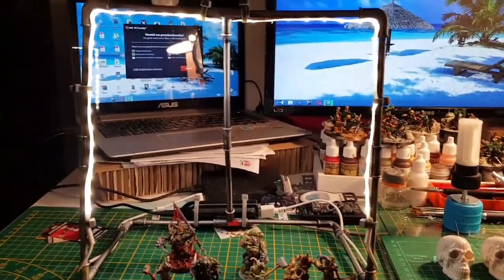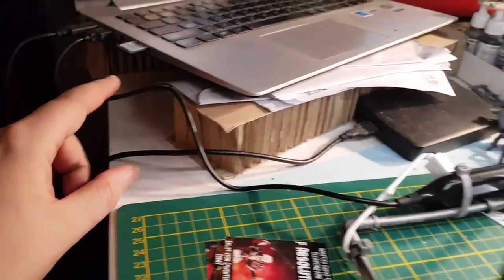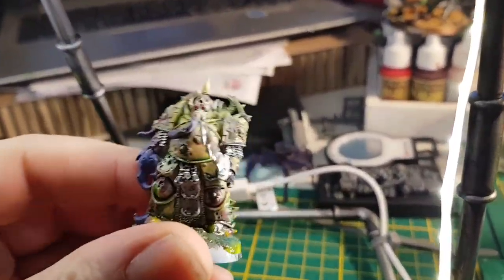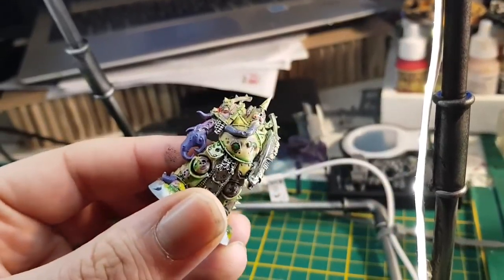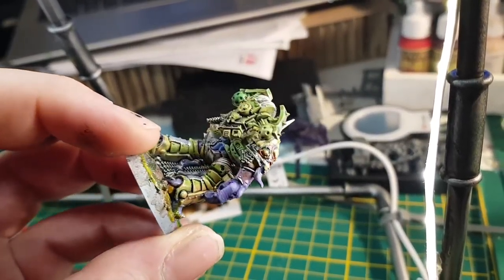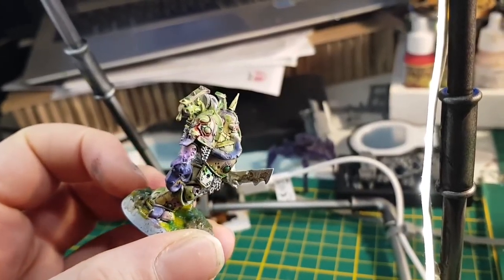So I've built my arch light. It's connected to the USB - that's the USB hub - with two USB cables connected to the actual LED strips. Now, these LED strips are 80 lumen each, and I'm really underwhelmed by the light quality. The models look okay, but there's a certain yellow tint to the light and it's just not bright enough. I want to see all the details. I'll probably have to wait until I get a brighter light - I need to go at least 160 lumen, double the light intensity.